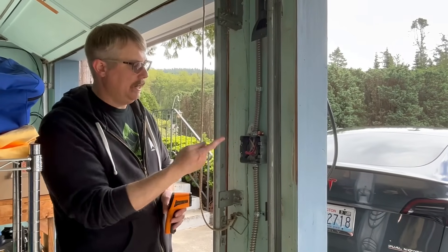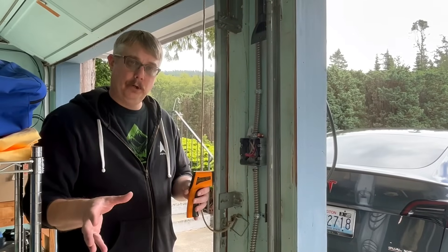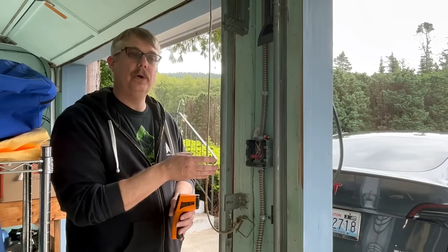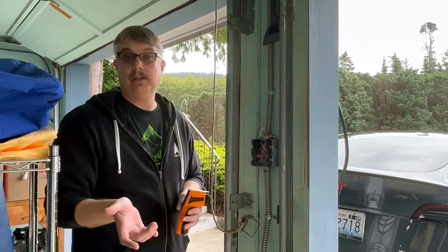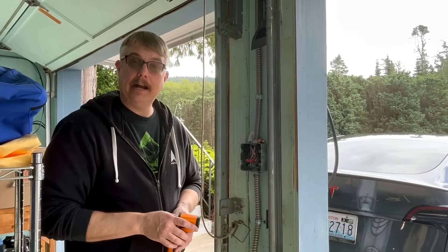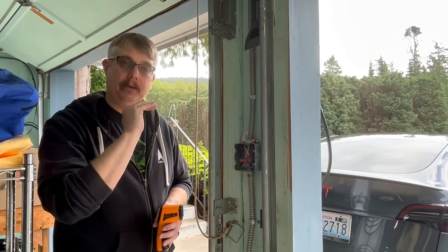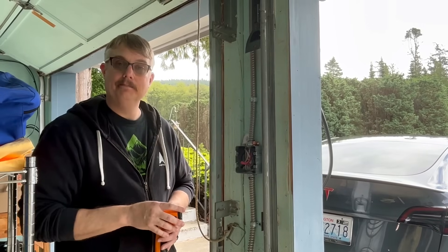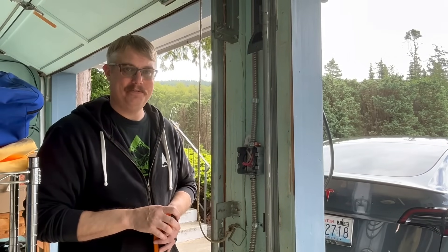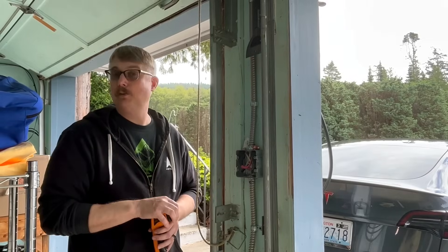This temperature gun is not high-precision test equipment — all it's doing is giving me a generally good idea if my wires are heating up uniformly. They're not going to give me an exact number. We're going to check them again in an hour. A handy temperature gun is great — you need current running and then you can check your temperatures. The first time you put a charger in, this is a good way to get a baseline. Thanks for joining me at Tesla Northwest and EVs — hit that subscribe!